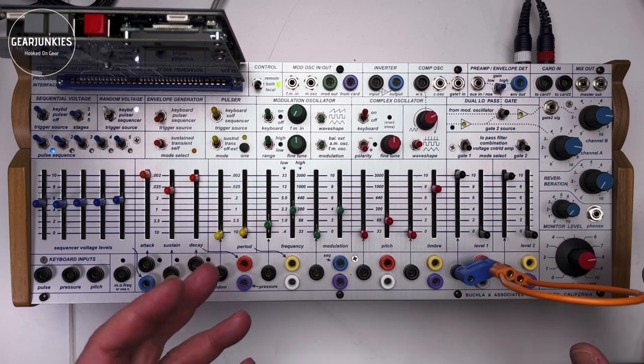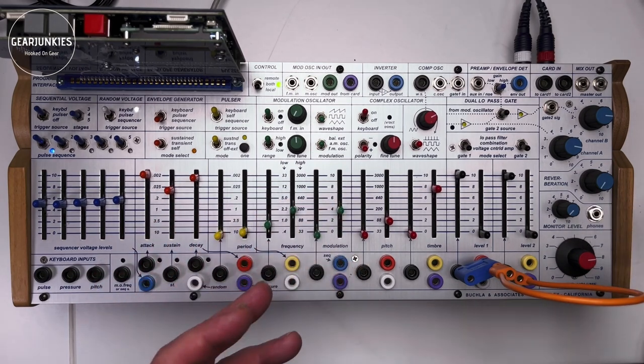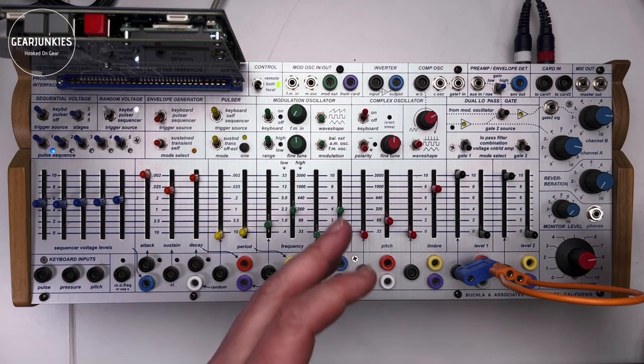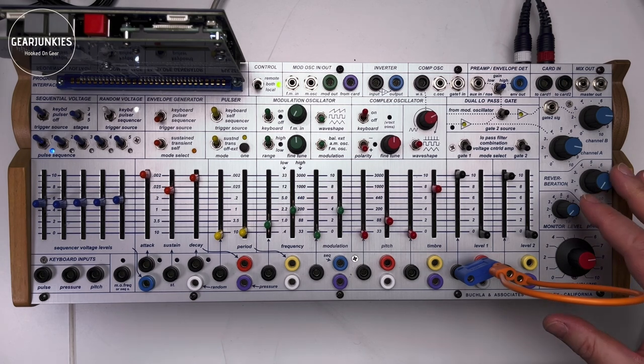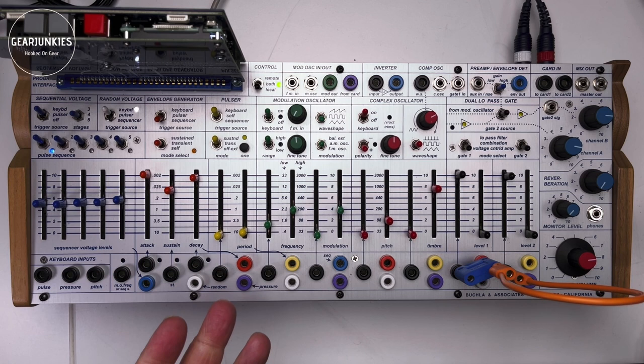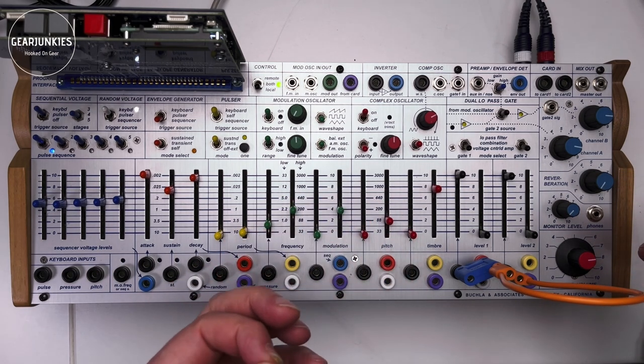The easel has no filter section, like subtractive synths have. By setting the timbre low, the sound already contains fewer overtones, so a dedicated filter system is not necessary. Instead, a low-pass filter is integrated into the VCAs, creating a so-called low-pass gate. This is one of the most distinctive parts of Buchla designs.